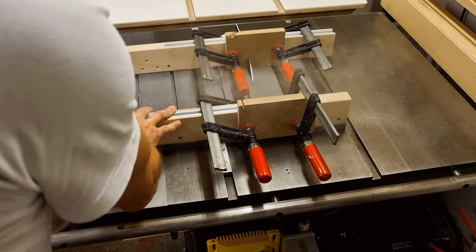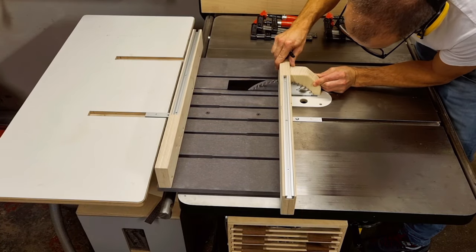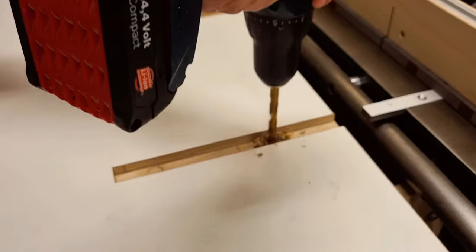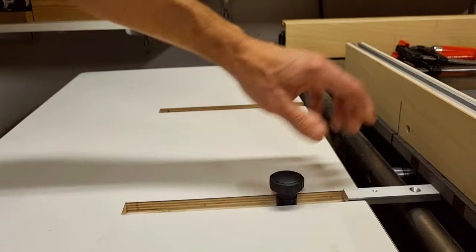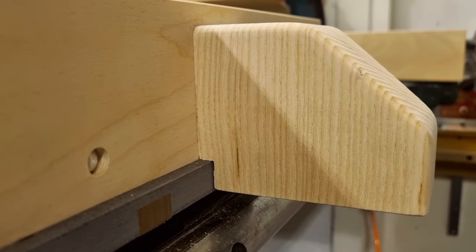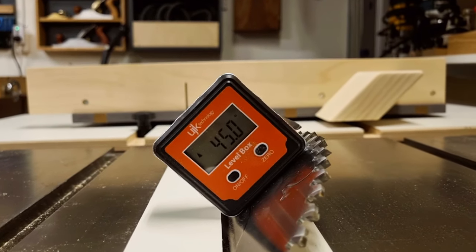It's time to make the first cut, and here I use a support piece on both exit sides to avoid tear-out. With that cut done, I can now use my blade guards to set the stop position for the sled, and here I install the threaded knob into the threaded insert. I then install the blade guards — and here you can see the landing groove I mentioned before. I make the first real cut and check for squareness, and also make the first cut in the 45-degree setting.